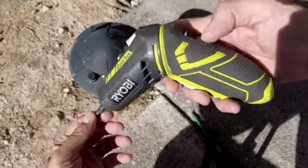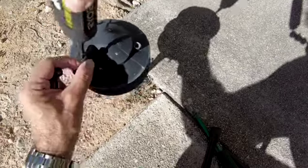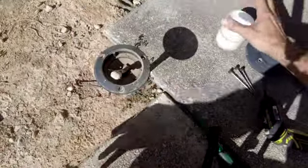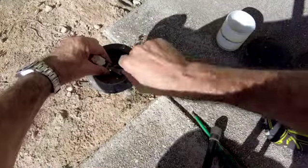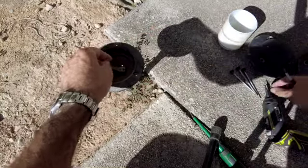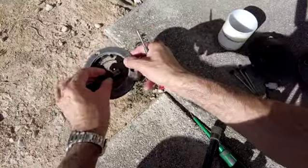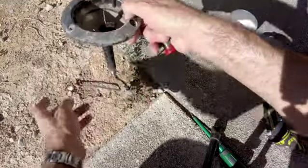Now taking these things apart is an absolute piece of cake — there's very little to it. There's a couple of screws in the top which have to come undone. There you go, they're out. So the lid comes off, we've got a tiered piece, another piece, and we've got a bulb. To get that bulb out you just need a little screwdriver — undo this little screw in here. Once that screw is out the unit can come off, the bulb comes out like that, and this connector will slide down into the pipe and come out as you can see.